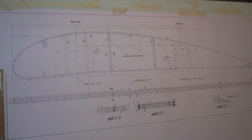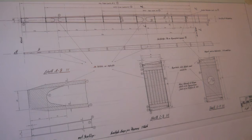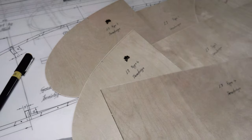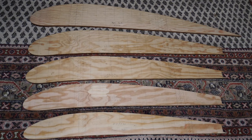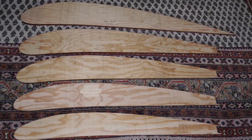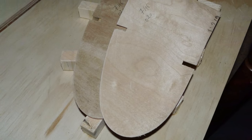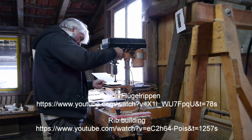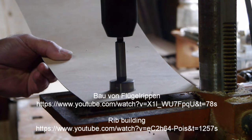The trajectory plan is used to create single drawings for each rib, which in turn are used to create the templates to build the ribs and all other parts including the spars. Our drawings are available on request. The building templates are multifunctional tools — they are used to cut out the ribs from plywood, true to shape, and to assemble the individual parts of the ribs. The plywood ribs are first marked out on a plywood panel and roughly sawn out with oversize on the bandsaw. Everything that protrudes is then milled off along the milling template using the flush milling cutter. The openings for the internal cross bracing of the wing are drilled with a Forstner bit. We have already documented the construction of the ribs in a separate video.